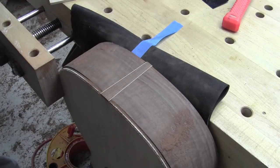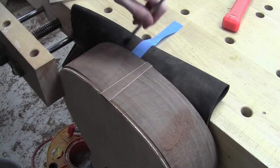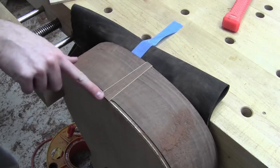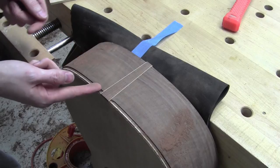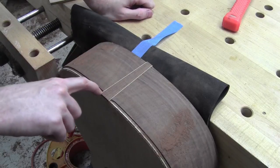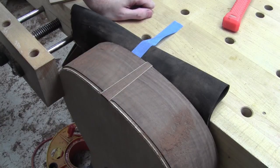All right, so then the next steps are just going to be, I'm going to take a chisel to that area and clear that out. Then we've got to cut these short, but not fully to the depth of this rabbet. I want to go this rabbet minus the thickness of this maple, because I'm going to attempt to do a bit of a weird miter type joint right there. So we'll see. I'm gonna get my tooling set up and figure out my process.